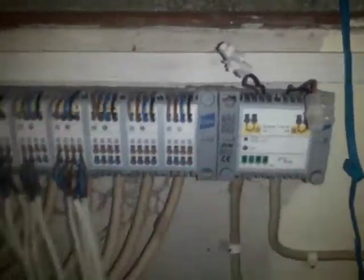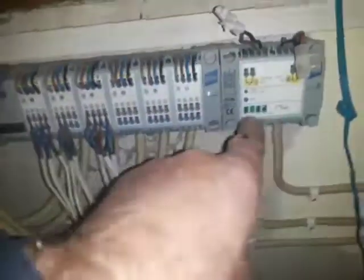It opens the valves, these valves, to the areas where the stat is. So it will open the valve here to allow hot water to flow into the underfloor area in question. And it does two more things. It sends a signal via this module to the pump to start the circulation, and another signal to the boiler outside to start up. So the first thing we notice is this module is not working. It's not sending the signal to the circulation pump or the boiler when we get a thermostat on.